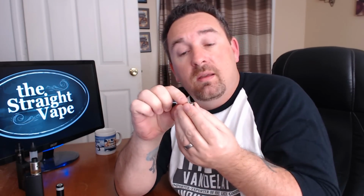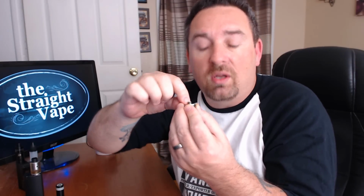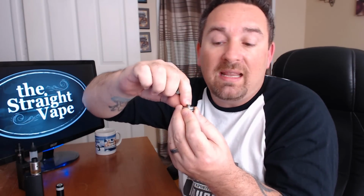The positive part of the battery can cross across or touch across the positive pin and the outside lip of those threads. So what you have there is a dead short, because the negative part through the mod is connected to the negative. So if you get a short between the positive and negative, which you have right here, then you have boom, then you have explosion.